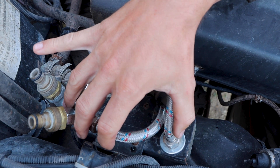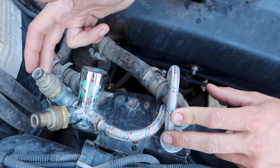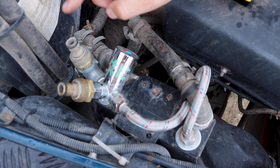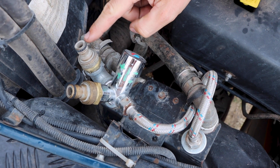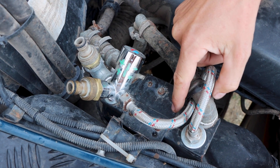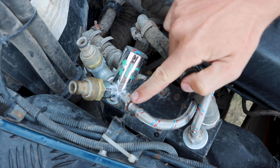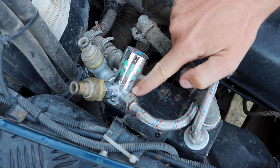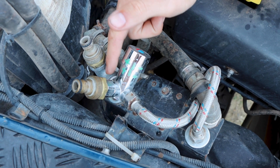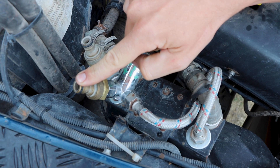This side of the heat exchanger is the inlet and that's the outlet for the shower water, or the clean water, and this is the coolant side. The cold water enters here, flows through the heat exchanger, gets heated up to 85 to 90 degrees, and then goes into the mixing valve. On the other side of the mixing valve we also have access to the cold water, so we mix it to a temperature that's nice to shower, and here's the exit.